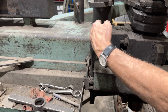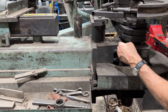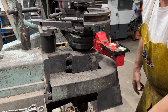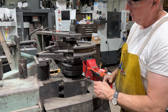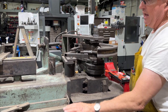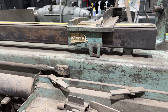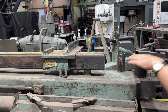I bought some one inch plate, which essentially caps the tube, and then I've got this structure that holds this big bearing. There are actually two of these bearings above and below, and that forms the capture bearing mechanism for the three inch cylinder. There's a lot of fabrication — this is just a little shroud, as is this. There's a limit switch back here, and as the machine bends, the chain has a little stop on it. When it hits the limit switch, it stops.